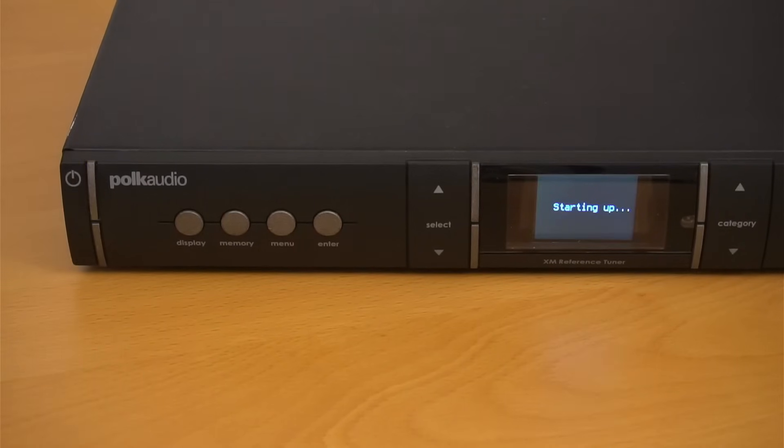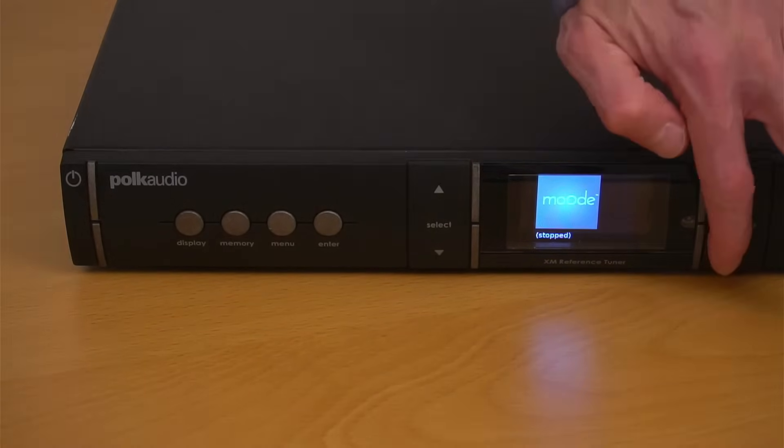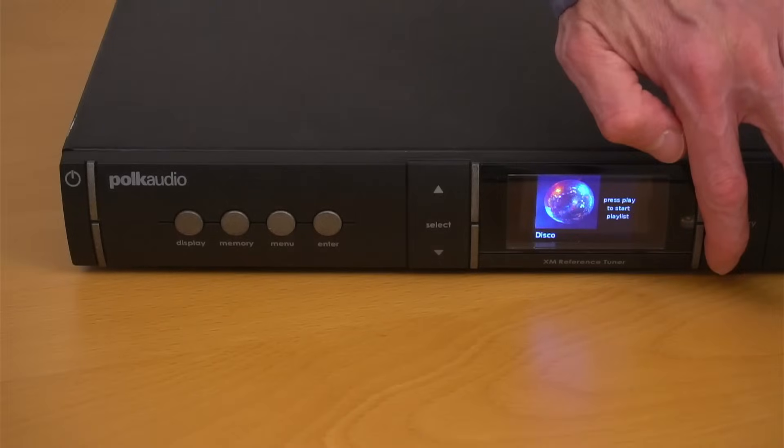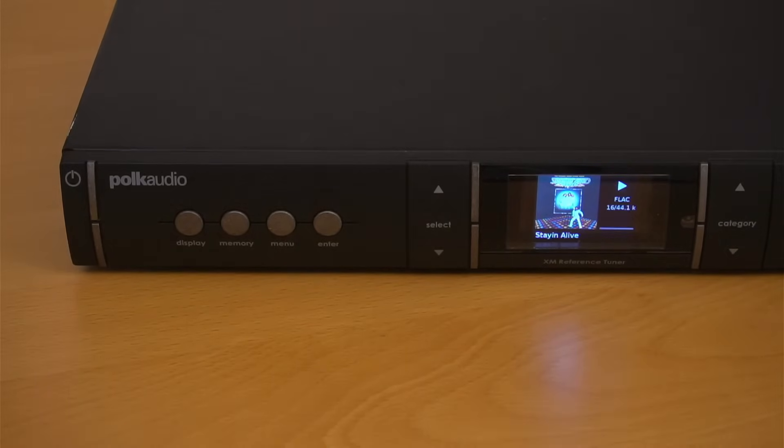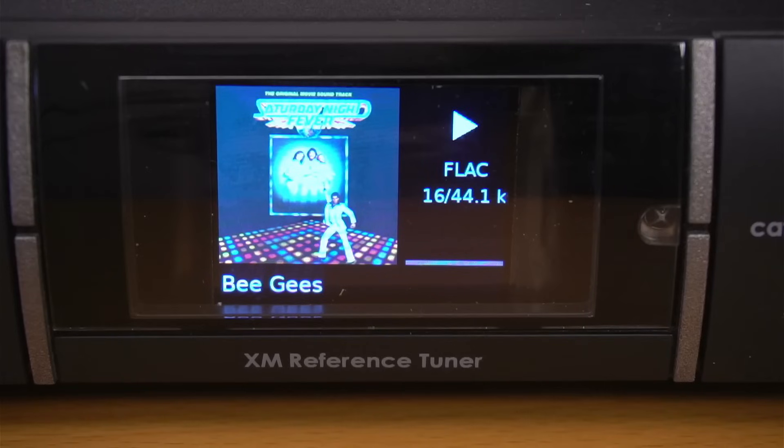The power button is wired into a Pico microcontroller which gracefully starts up and shuts down the Pi. The other buttons are wired into the Pi's GPIO pins and perform various functions like choosing a playlist. There's a high-res LCD for displaying album art and song info, along with a playback progress bar. It rivals the features and audio quality of $1,500 units, but you can build it using about $120 in parts and some open source software.